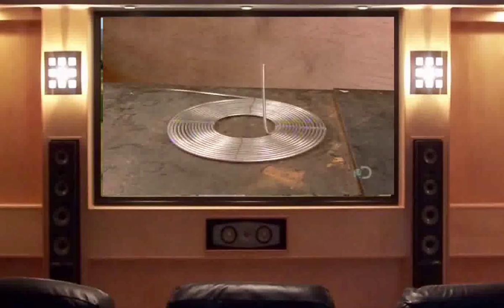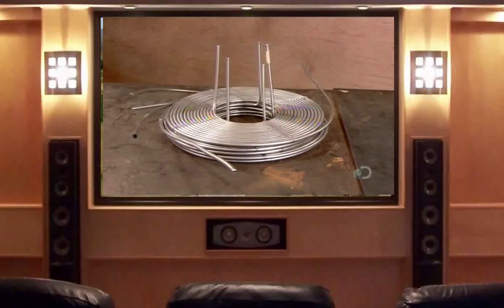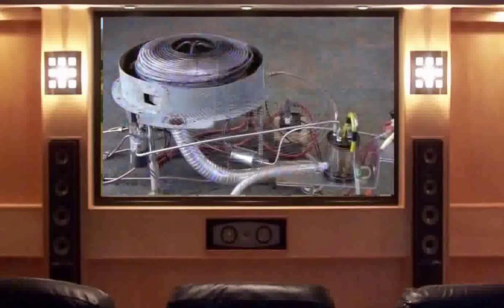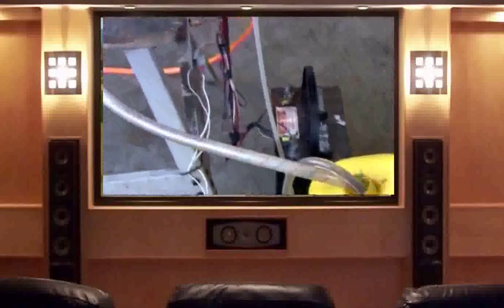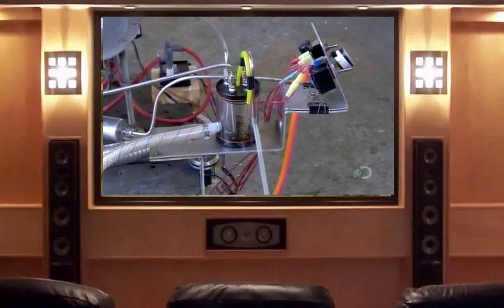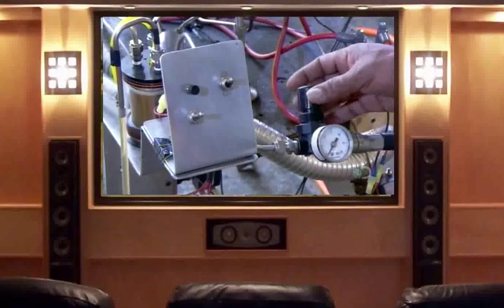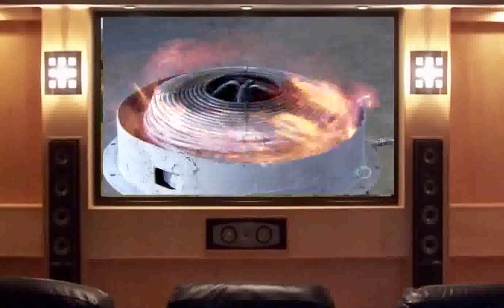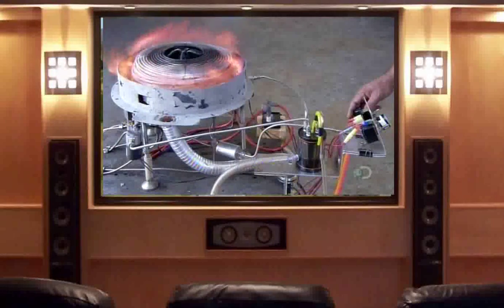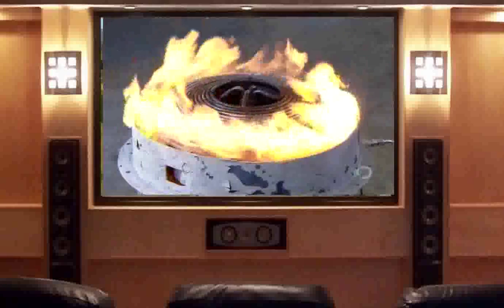They stack 6 of these coils — one to feed steam to each cylinder. This nest of tubes forms the engine's primary heat exchanger. They test it using any of a number of fuels, even waste fuels that would otherwise be discarded, such as used motor oil and used vegetable oil from restaurant fryers. Virtually anything that burns will do the job. The fuel combusts at low pressure, not at high pressure as in a gas or diesel engine, meaning burning fossil fuels to make steam produces far fewer greenhouse gases, and most hydrocarbons burn off completely within the sealed combustion chamber.